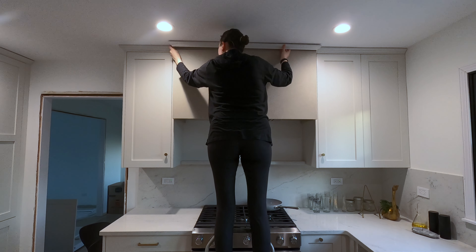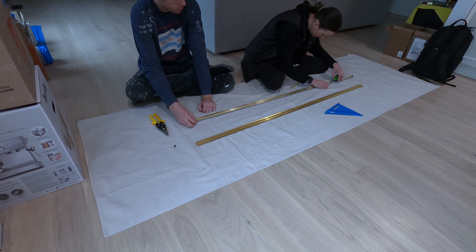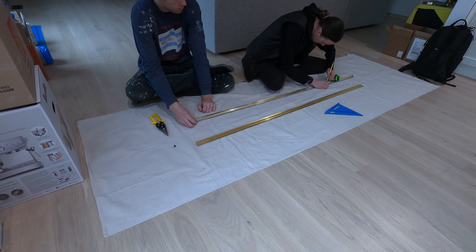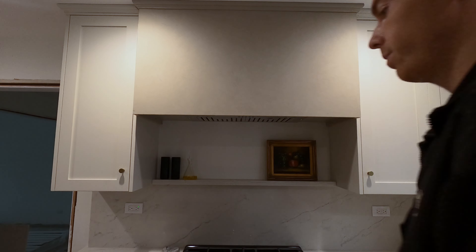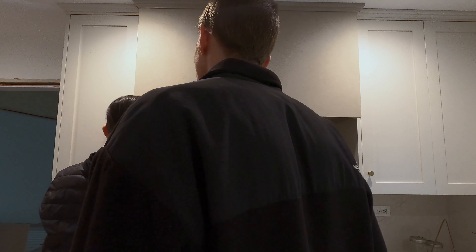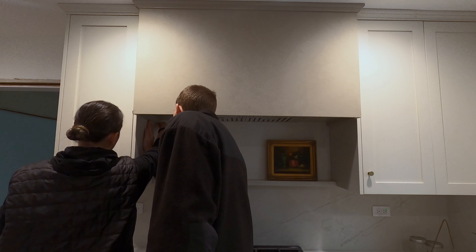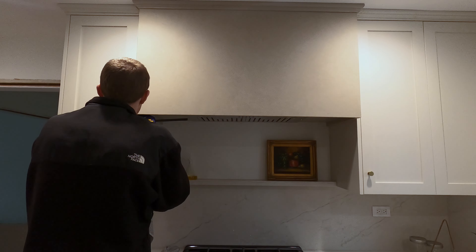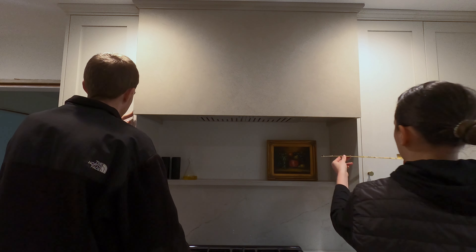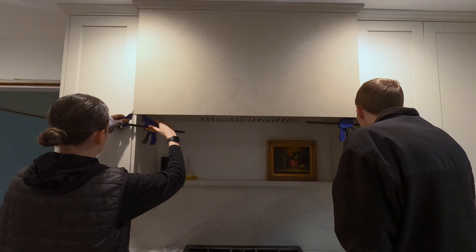Now that the Roman clay is done, it's time to install the crown molding and our brass trim. We cut the brass trim with tin snips, which was really easy, but the difficult part was installing it. We applied liquid nails to the back of all the pieces, then found it difficult to hold them in place — there wasn't much to clamp to — so we ended up MacGyvering some tape clamps and a piece of wood in the back to hold pressure on all the pieces. In the end it turned out great, though it took more effort than we originally thought.